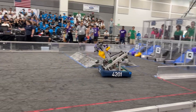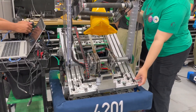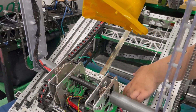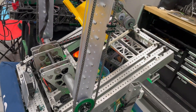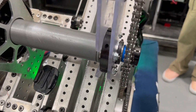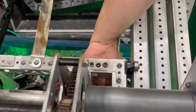Now we're going to go over the elevator on this robot. So Giselle, take us through it. We have a three-stage elevator that functions with bearing blocks on the top and bottom of the 2x1s. What's special about our elevator is that for the top we use a constant force spring to make sure the top gearbox stage goes up first, which is important so the intake doesn't interrupt any part of the top of the elevator. Inside each of the 2x1s we have a pulley and rope system — one single infinity rope that goes throughout every stage of the elevator, all the way through top and bottom, hitting our elevator with rope tension screws in the center.